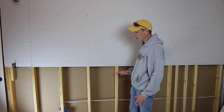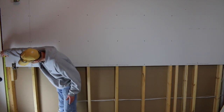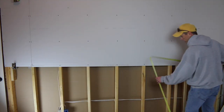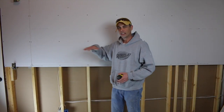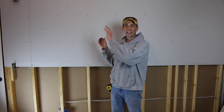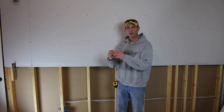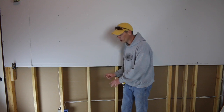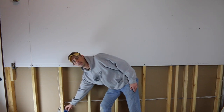Now we've got the upper hung, so we want to hang the lower. I'm measuring up from where the sheet's going to end — on the far side up from the concrete it's 45 and 3/8 inches, and where the sheet breaks it's 45 and 1/16. Our concrete in this basement is not actually level. So again, like we did on the wall, we take the shortest measurement. I'm directly on concrete, and concrete sweats and attracts moisture, so I don't want my drywall touching the floor. I'm going to cut it a quarter inch shorter, and remember, the base trim is going to cover any gap we have at the bottom.